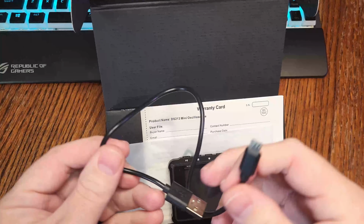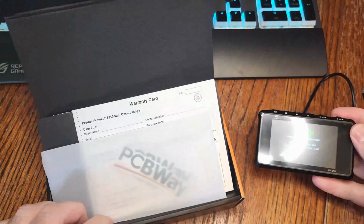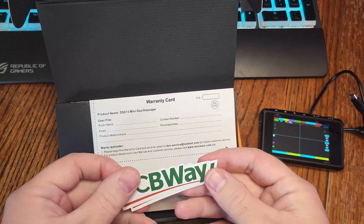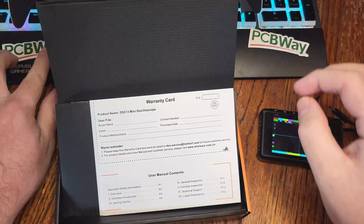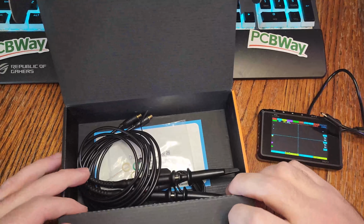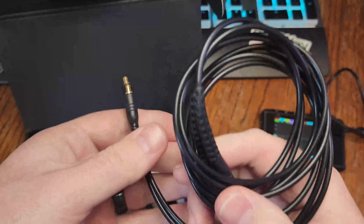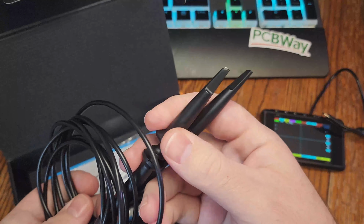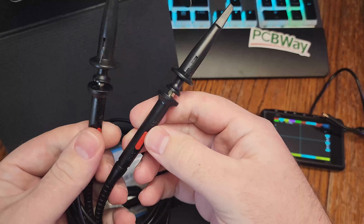So we were able to see on the oscilloscope the sound wave acting normal when it was just music playing, and then when I failed miserably at the game, you can see the sound waves just blow up. So if nothing else, you can test sound with the oscilloscope. Were this not working, if it was an actual issue inside the Commodore 64, we'd be taking these little tiny probes that you can see here and checking the SID chip to see if it's functioning. Great video on the 8-bit guy on how to actually fix the Commodore 64 itself if it's not outputting sound.